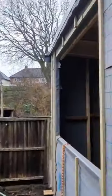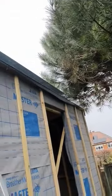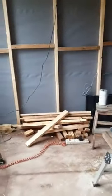I had to use the window in the weather to get the roof boards on. I've got the rubber roof on the top — I haven't got it stuck down yet. I'm just letting it relax and get the creases out of it, waiting for a window in the weather again to get the adhesive on. I've got some of the trims just screwed on temporarily to hold the edges down in the wind. It's been gusting 40 miles an hour in the night and it's not come off, so that's good.